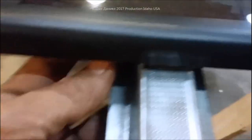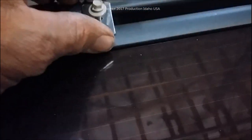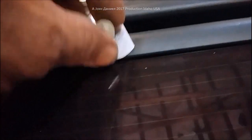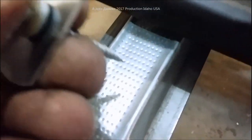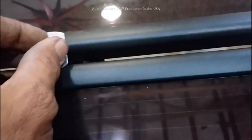This center support right here is simply going to be held with some washers. We're going to put a little bit of E6000 on it — just a little bit — and some on the end of the threads. That prevents these roofing screws, which really grab excellent in this material, from vibrating loose. We're going to use quite a few fasteners, which allows for very good support.